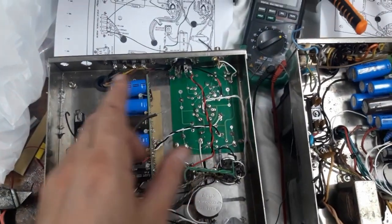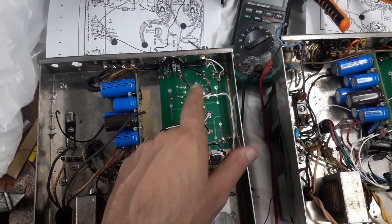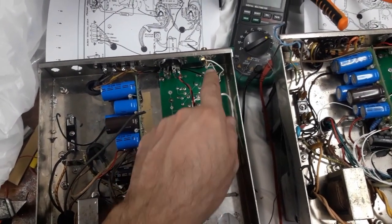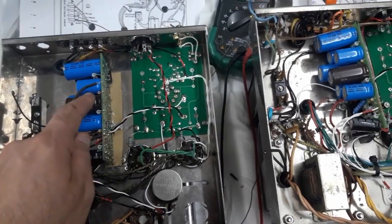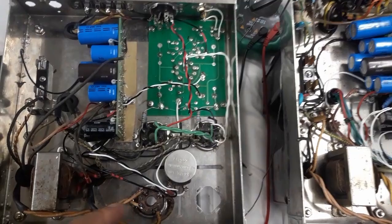Okay, after a couple of hours, I had like 2 sittings with this before and after my dinner, and I've done most of the wiring. I've done everything at the speaker leads here, the front panel stuff, the bias monitoring lines, input wires there. I figured out the board. I figured out all of the high voltage connections and the different nodes on this board that they go to.